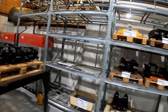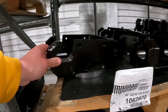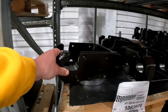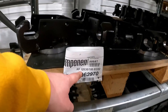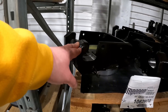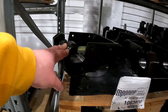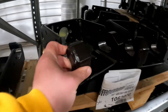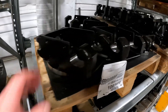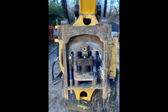These are all the bottom hitches for units and they then get put on shelves and await assembly. Things are manufactured in batches and then waiting for assembly as and when required. That's the new QS30-180 bottom hitch that will actually now be on my EC02 tilt rotator. We were having a chat about what's different on that and it actually solves the issue I have where I keep breaking the quick hitch ram — it's a slightly different design, which is good to see they've improved that.